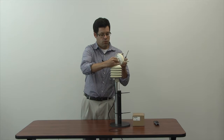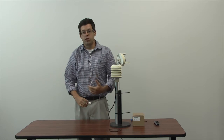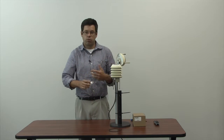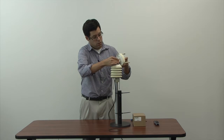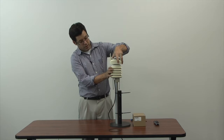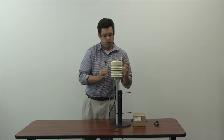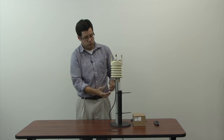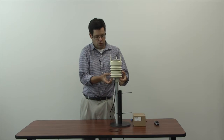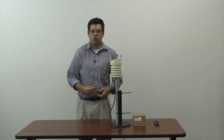Slide the PTU module out. Next, take the new PTU module from the replacement box, and slide it in the same way you pulled the old one out. It should snap into place. After you've put the new PTU module in place, lower the sensor body back in, making sure the holes line up with the screws on top, then push down until it connects. Finally, reset and tighten those screws using a screwdriver or hex wrench. Once they're tightened, turn on the data logger and power supply and you're set to go.